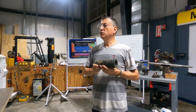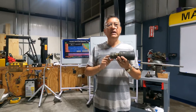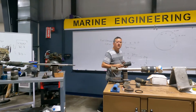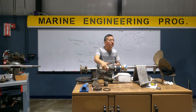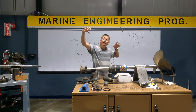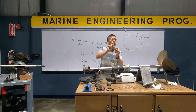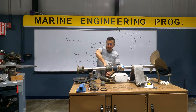What is the recommendation when you have a leak in a typical stuffing box? Number one: prepare tools, prepare a couple of bilge pumps, and work with minimum two people. Prepare flashlights — good light — because you need light and good tools to remove the old seal and buy the new seal.